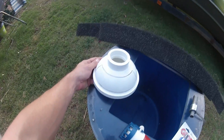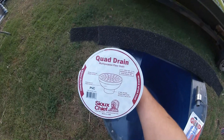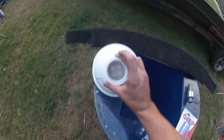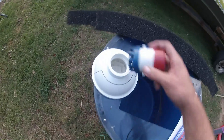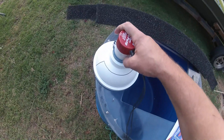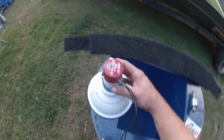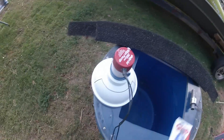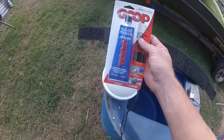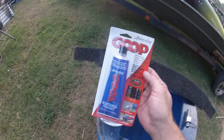At the local Home Depot you can find this fixture — it's a quad drain multi-purpose floor drain with a two-inch outlet. That is exactly enough room to slide the pump in place. This is a 360-gallon-per-hour bilge pump, but you can use a 500-gallon-per-hour, which is the same diameter so it'll still fit. You're going to use Amazing Goop, which glues, whatever, and bonds forever.